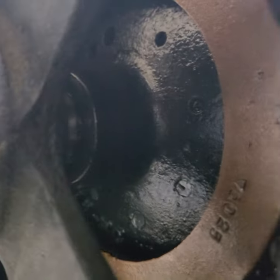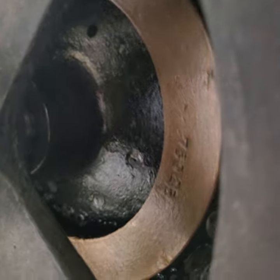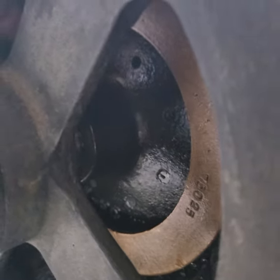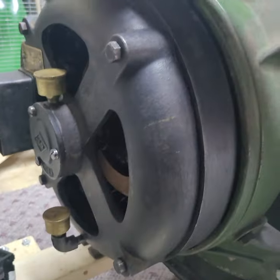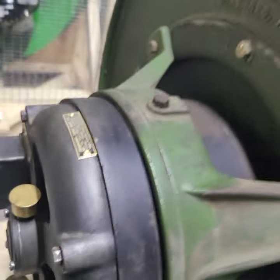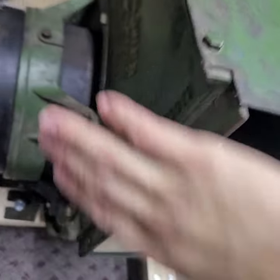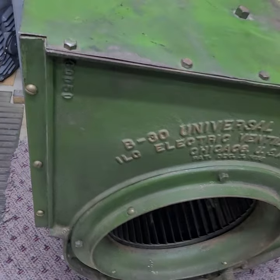And the rotor, there's the gorgeous rotor that ILG had back then, with the copper ring and the copper bars through it. Cleaned that up. That rotor is 7 inches in diameter, so you could pretty much put a 45 RPM record right over the top of that thing. Now, the entire housing of the motor is about 12 inches in diameter across. So that's pretty hefty, and the whole thing weighs 120 pounds, just the motor by itself. It's quite heavy, all cast iron on the sides here. Nice and solid ILG construction, typical of that company.